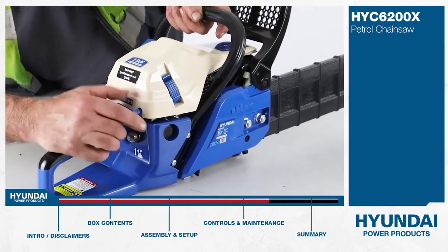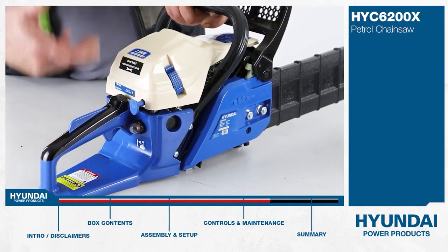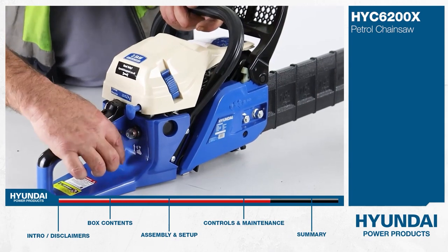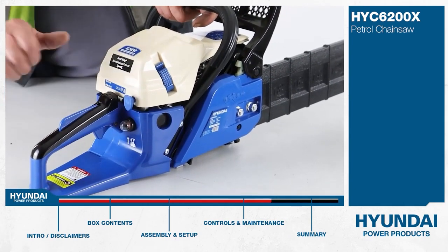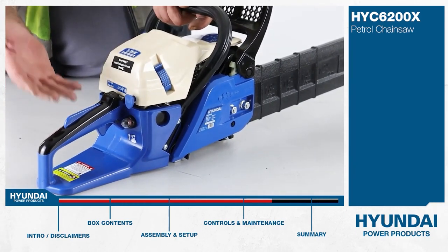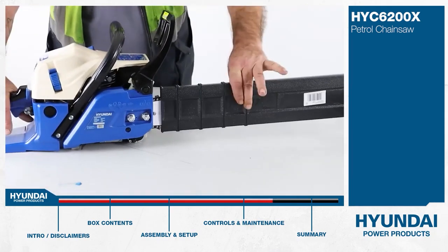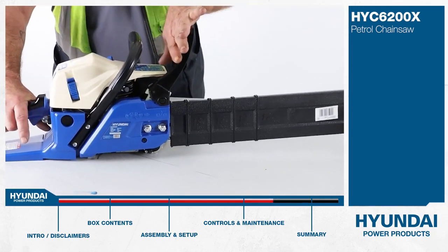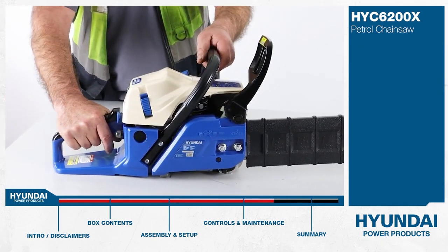So if the choke were on and the engine had attempted to start, so it did like 1 or 2 pulses, I now turn the choke off by pulling the throttle, and the choke goes in, switches the choke off. Then I would continue pulling, the engine will start up, and we're ready for use. Obviously, we would remove the sheath from the chain. We're making sure the chain brake is on. We'd let it idle just gently for a few seconds.